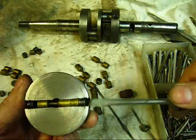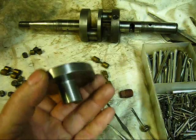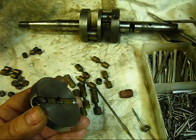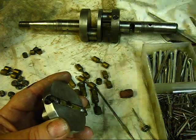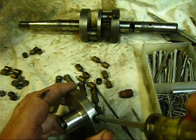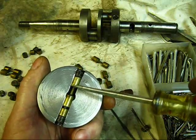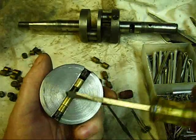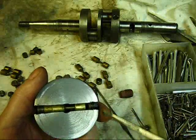It's all dependent on where you set this, and you cannot set this unless you are adjusting for RPMs. You have to put a meter on the end of the crankshaft to know how many RPMs the engine is turning. If it's too much, take that plug out — if it's going too fast, screw it down a little more, which lets the fly drop down a little more and closes the intake some more.